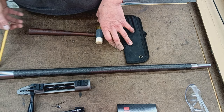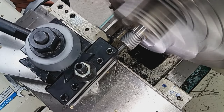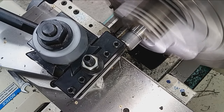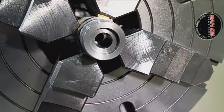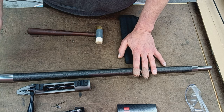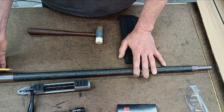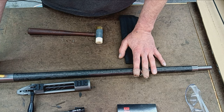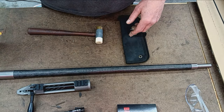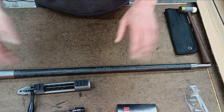Again, checking the entire time. We will pre-drill most of that out, bore it out with a high speed operation: low depth of cut, high speed, high RPM, and slow feed. That will just make sure the walls of the pre-cut chamber are true, square, concentric. So as the actual finish reamer comes in and cuts the chamber, it's not fighting a drill cut that's all nasty and trying to find center the whole time. It just gives the reamer a much nicer surface to work from and makes the whole operation better overall.